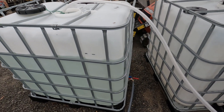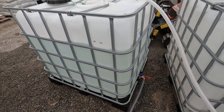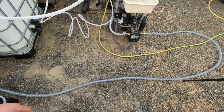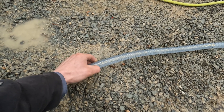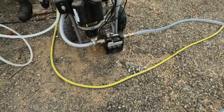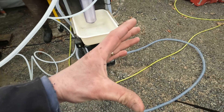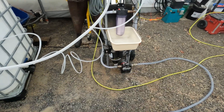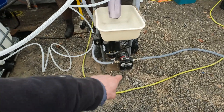Okay guys, so I'm hooked up to my first batch here. This is a tank we brought in with raw sap in it, and I've got my hose coming out. One thing I changed this year from the previous video is I went with a food-grade 3/4-inch PVC hose that is non-collapsible — you can see it's got a wire in it. What I found happening last year was I was using braided line for the suction end and it would actually be collapsing in some sections, and I was worried about the pump not getting fed properly. So that solves that. It's nice and clear, it's food-grade, so it's great.